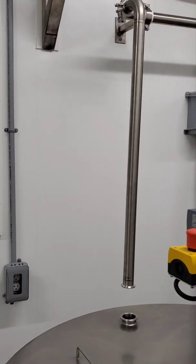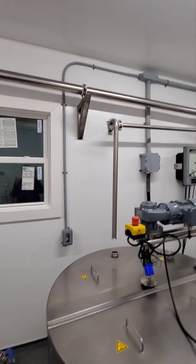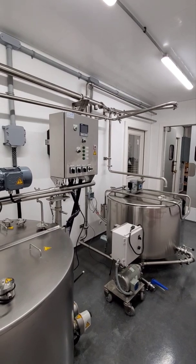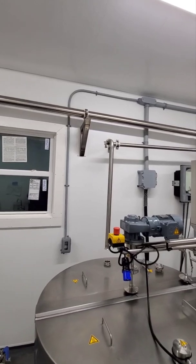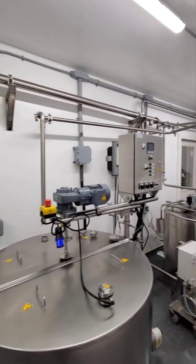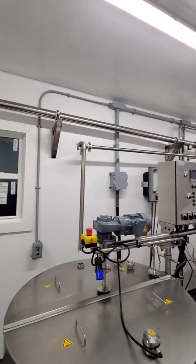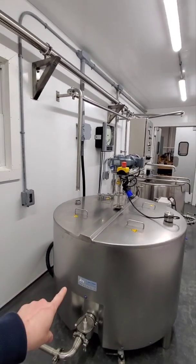This can be sent via piping back to the pasteurizer, as it is almost hooked up right now, or once we've reached whatever temperature we want, it can be sent to an additional bulk tank designated for cooling milk. Not every setup is like this — some people just go through their tube cooler back to the pasteurizer until the milk is cool, then run it directly to their bottler.